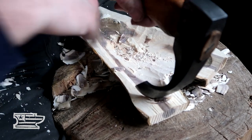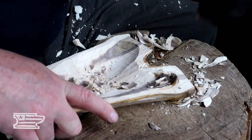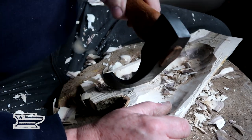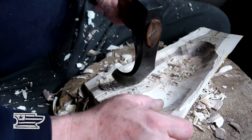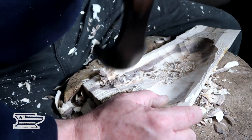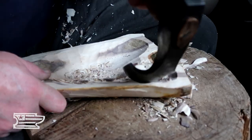I'm going to put my hand back here. Now I'm going in much straighter, not taking those long diving cuts. Trying to loosen some wood up here. This is no different than any other woodworking exercise — you're always looking to use the weakness of the wood to your advantage. The direction the wood is strong in, I'm trying to make it weaker by cutting across it, cutting right across its grain. That gives me the maximum advantage. I can't cut in this way because I don't have a good way to hold, so I'm back to cutting across and I'll clean up with my spoon knife.